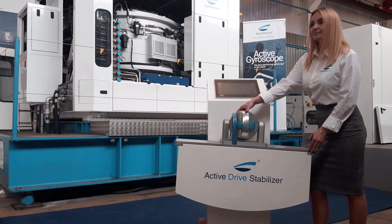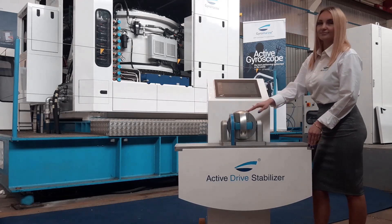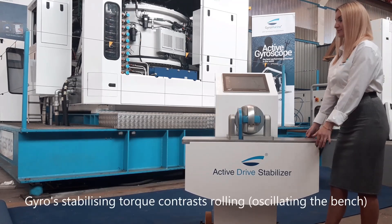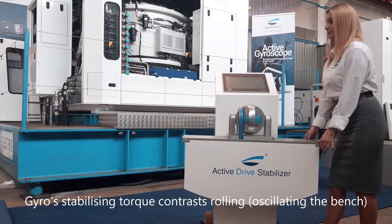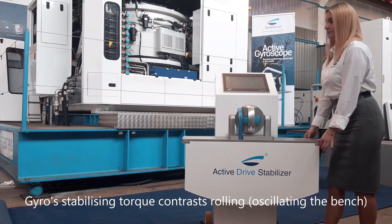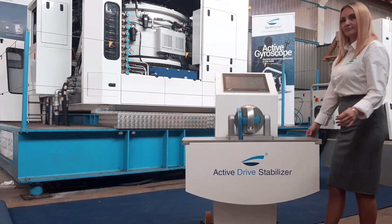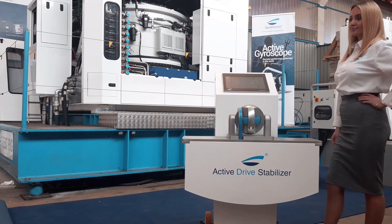In the initial instant, the gyro will be free to respond naturally. When the hull rolls, we see the gyroscope move. When the rotor assembly is pitching, stabilisation is involved. As the gyroscope moves, we experience resistance to roll. This is the basic operation of any gyroscope.